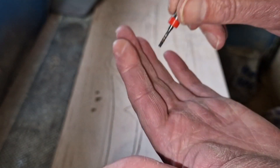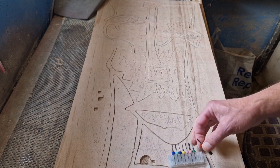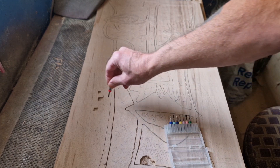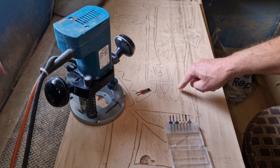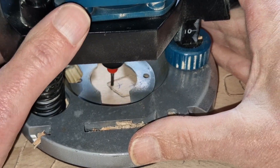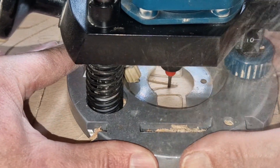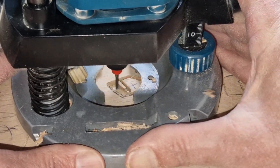I'm going to use one of these little end milling bits now — these are ideal because they'll smooth out the bottom section as well as the sides. So where you think maybe you've not quite got it, you can come in and just nibble away with this. We simply just pop it into the same adapter collet, set it to the same depth, and start removing all those areas that we put our little crosses on.